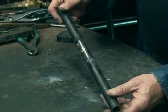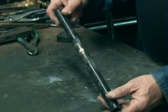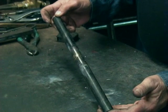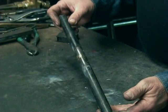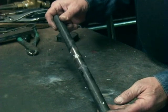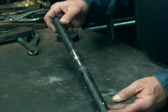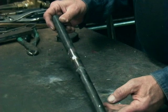Here's our pipe, now brazed and cleaned up a little bit. Since it was clamped in the vise, it's still straight. But if you're going to do pipe like this, make sure that you grind it so you have that V-section in there so that the bronze can get down in instead of just being on top.